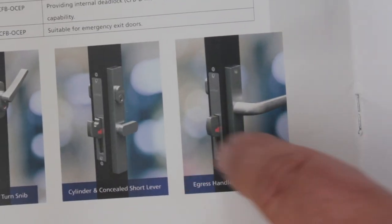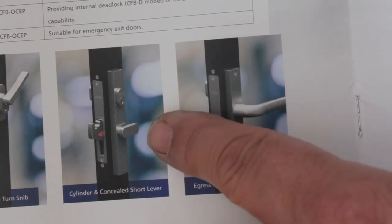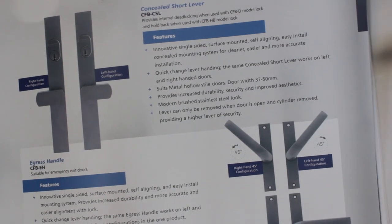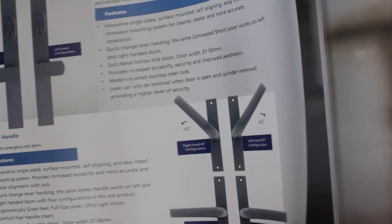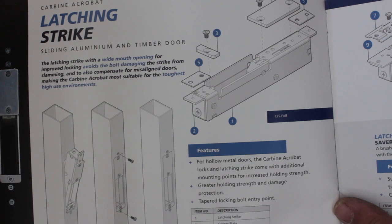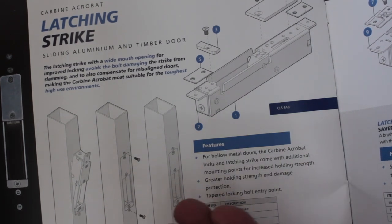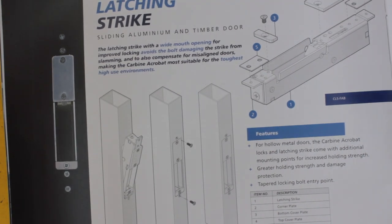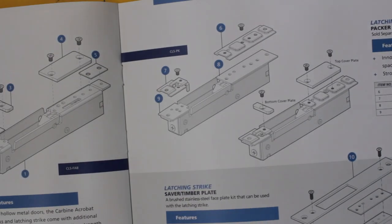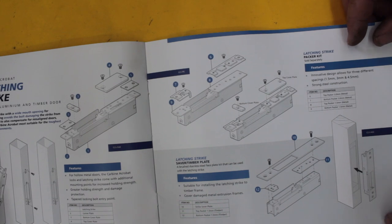So if it's a fire exit, that might be important. They've even got an outside one — that would be less work on the key rotating it: you unlock it and then you rotate the handle. So there are some new features there. You've got handles left and right, internal handles, 45-degree action — so they would meet fire regulations as far as exiting. For double-door aluminium slide-together doors, this is that latch-type mechanism where this part goes in and latches onto the other part — it'll just go straight in there and latch. A lot of the time people put the bolt out and slam them together, which gives it a real workout. I always tell customers it's better to put it together first and then flick the bolt. So there's the latch keeper — or latching strike, I guess it would be called.